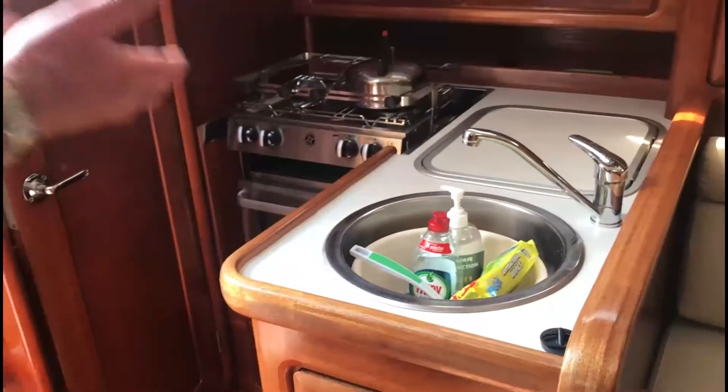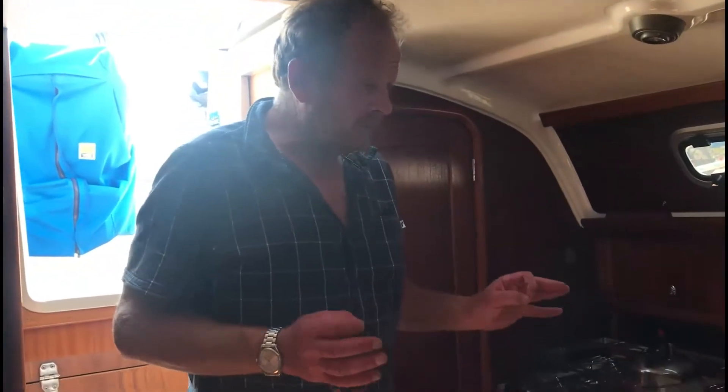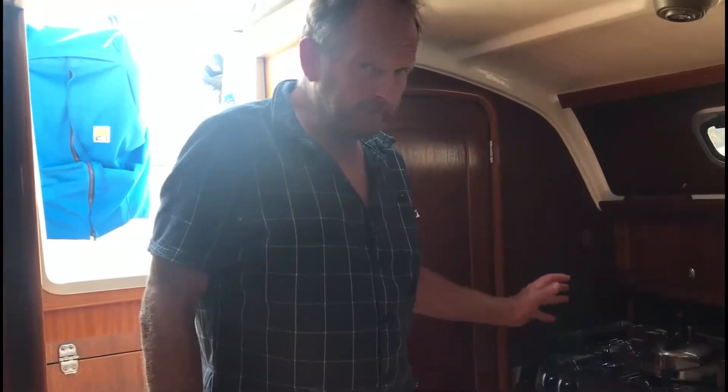Perhaps one of the most important things is the galley, so let me show you that. Now the most important — and perhaps the most dangerous — thing we carry on these boats is the gas. So what we do is switch the gas off when the cooker isn't being used. The tap for the gas is in a bit of an odd place: it's underneath this port saloon booth here. When it's in line with the pipe it is on; to close it, simply turn it 90 degrees and that is gas closed. It's going to remain closed for virtually the whole weekend, except when you want to make a cup of tea or cook something — then simply turn the gas on and the cooker will be ready to go.